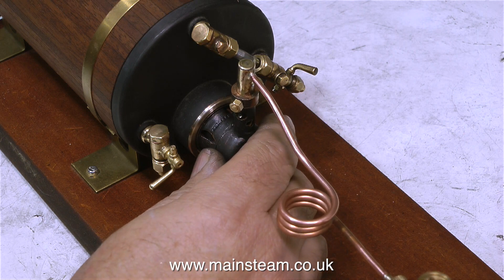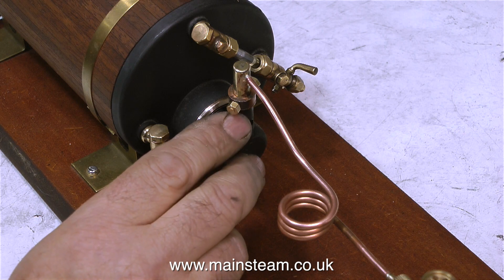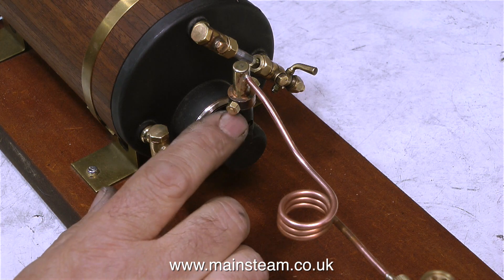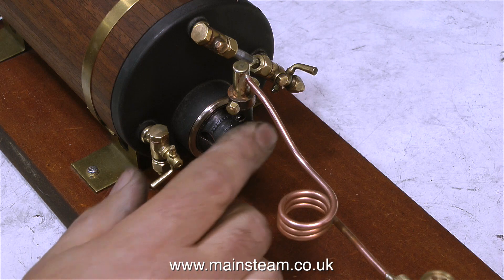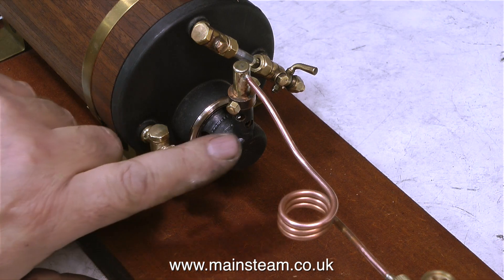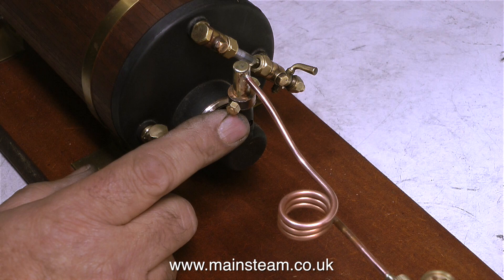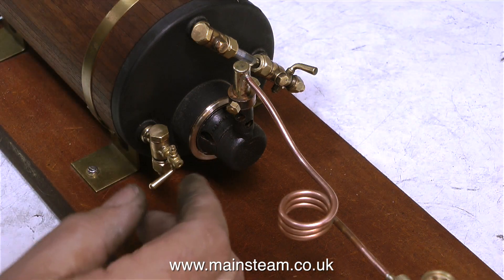I'm trying to show what it's like in the real world. I used to use Mac Steam boilers for most of my boiler applications. Before Mike Abbott retired and wound up Mac Steam, I used to speak to him from time to time, generally about gas burners. I tried various experiments to make them stop the howling. The howling is a resonant column of air in the tube, like a musical instrument. I found that if I blocked one of the primary air holes, often the howling stopped. The idea was to fit a ring that you could slide up to partially cover the air hole - and that worked. Mike started fitting these to his boilers and they definitely worked. But there was a trade-off: incomplete combustion. Insufficient air equals incomplete combustion, equals a really foul smell coming out of the chimney and possibly carbon monoxide.